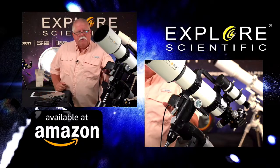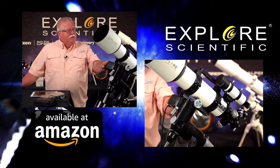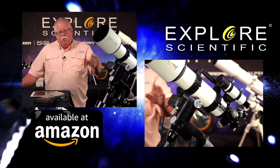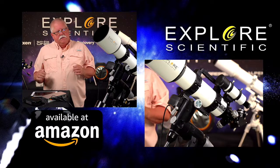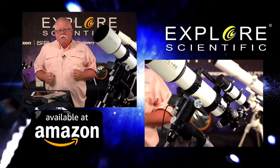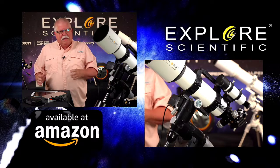Now, the Exos 2 GT with PMC 8 is a great mount. The drive motors are micro stepper motors, which are controlled by a circuit board. And that circuit board has a torque limit setting. So in an old DC drive servo motors, you just apply power and they're at full torque the whole time. You can't regulate that torque. So they just drive and drive and drive. If it runs into something, it just keeps pushing until it starts tearing up the gears that are inside of it.